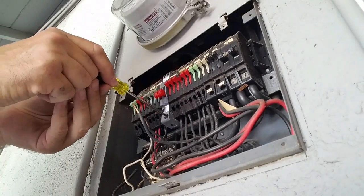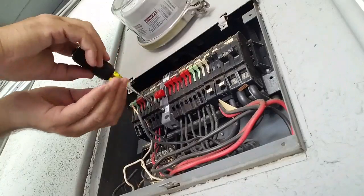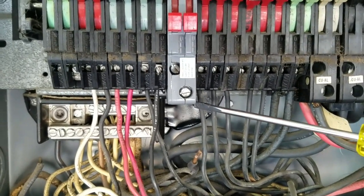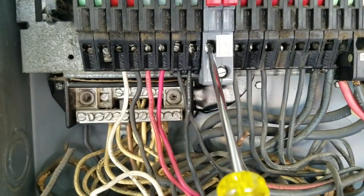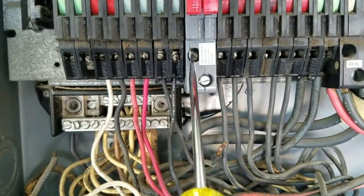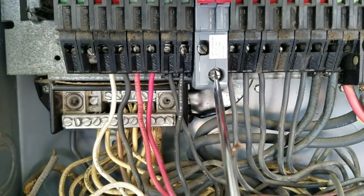Let's back these two screws off just a little bit so we can get our wire in there. What we have here is two separate legs on the same breaker at the same pole. It's not a two-pole — it's two circuits coming off the same pole. This screw is for one of the circuits, or one of the wires for this handle here. This screw is for the other circuit and the other wire, which is this handle right here.